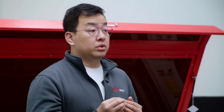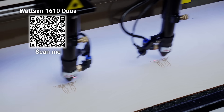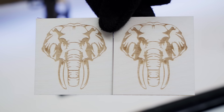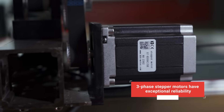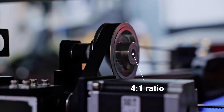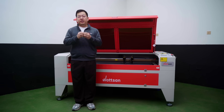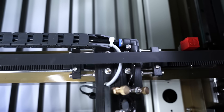In the case of the Daws model, it is especially important to have a reliable and stable gantry because two laser heads are working at the same time, and even more so when engraving. Look at how the heads are actively moving and the image is still sharp. Thanks to the sturdy support, the 1610 Daws has three-phase stepper motors that are more accurate and smoother than their two-phase counterparts, and the 4:1 ratio belt reducers take the stress off the motor and improve accuracy. Also installed are 3M belts with increased tooth size, which last longer and are not prone to abrasion.